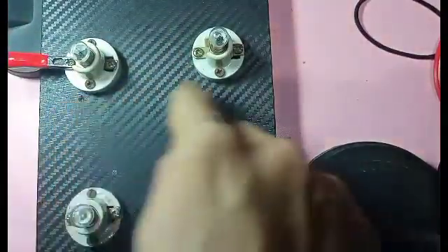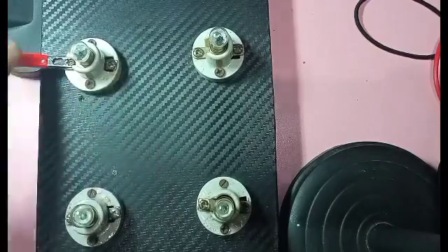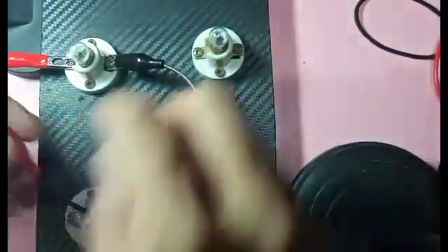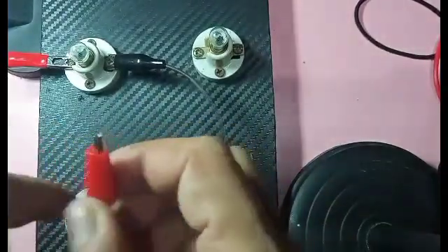Let's designate the lamps 1, 2, 3, and 4. In this case we're going to use two lamps first. The other side of the lamp — if you have a positive entry here, therefore one side should be negative, black. It's easier to measure the voltage and current of DC circuits if you're using this red and black color coding.